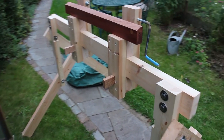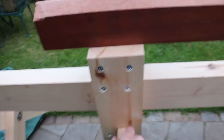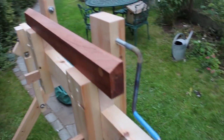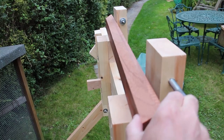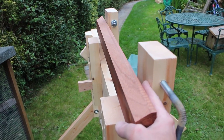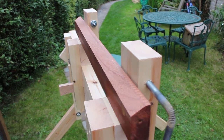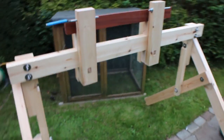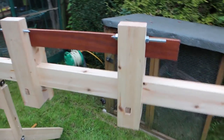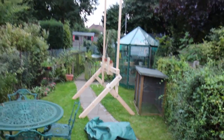I've now got the poppets in position on the lathe and they're holding really very firmly with these wedges — that's a good system. I've made a tool rest out of a bit of scrap wood, slightly beveled off, and that just rests against there. You do need some spacers — I'm going to make a few little wooden spacers to bring it out if I'm turning something of a big diameter. That's the general idea of the tool rest; there's the crank handle, all working. So I'll get the uprights installed now — you want those to be about 70 inches above the surface of the bed. Here's the finished pole lathe all made up.